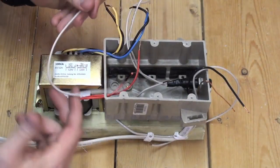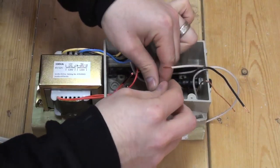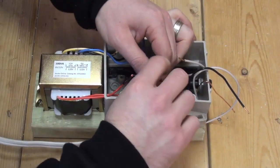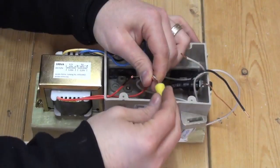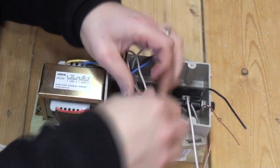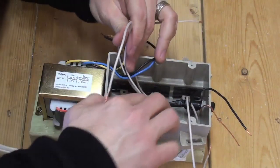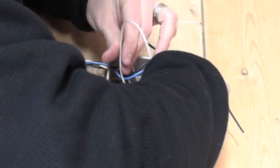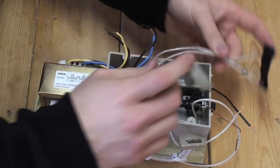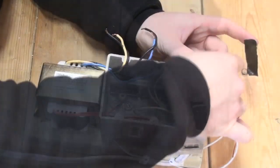Take a length of stripped connection wire and attach it to the neutral line from the transformer and the neutral line from the main 14-2 service wire. The neutral lines will not be necessary until later in this tutorial, but it's best to perform this step now so as to bury the wires out of the way. Tape all unnecessary wires to one side so as to not confuse and give more room to work with the electrical toggle switch.